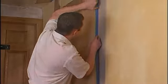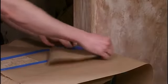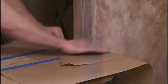When masking, you have a wide option of tools such as a masking machine with paper or masking tape with plastic. Use plastic or paper to cover windows, floors, and countertops. Basically, you're masking as you would for a paint job. You can leave a slight reveal of about 1/16 of an inch of the adjacent substrate exposed, as you'll be adding thickness to the wall.